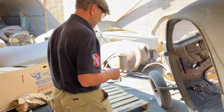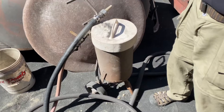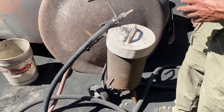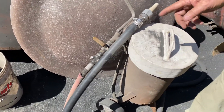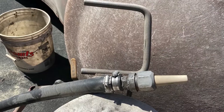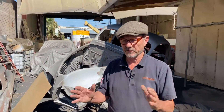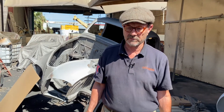This is a pressure blaster — an old-fashioned unit we've had about 20 years. You don't need a huge reservoir; this one holds about a bag and a half and you just keep feeding it. Compressed air comes in through a valve from a large compressor. You could also use a smaller compressor that builds up tank pressure — it would work for a while. A siphon blaster doesn't require nearly as much air but isn't as fast. For most people a siphon blaster is plenty good enough — if you're doing a door at a time there's no point to a pressure blaster.